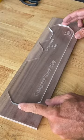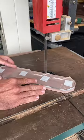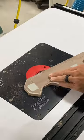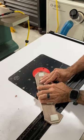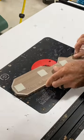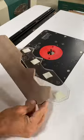I'm working on a special project, one that's going to have an inlay top. I wanted to use black walnut and really mix it up with a fun design, so I came up with this acrylic shape and I'm flush trimming it on the router table using a quarter inch flush trim bit to be exact. I want to make sure these details are flushed perfectly as this pattern is going to keep repeating itself over and over.